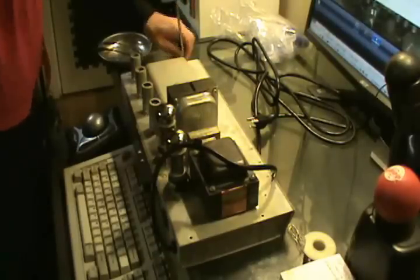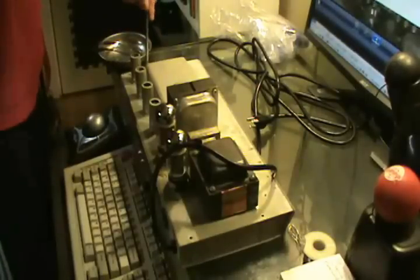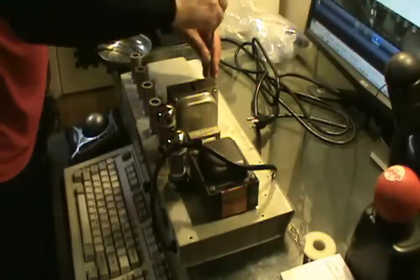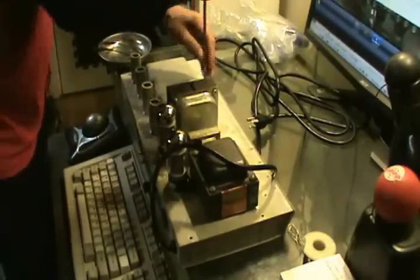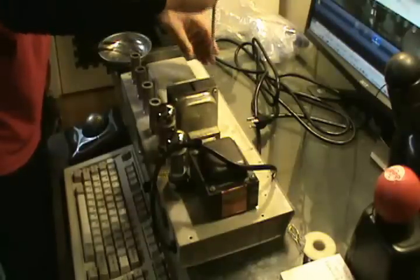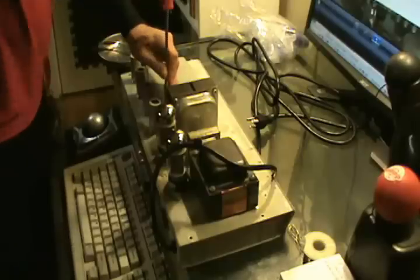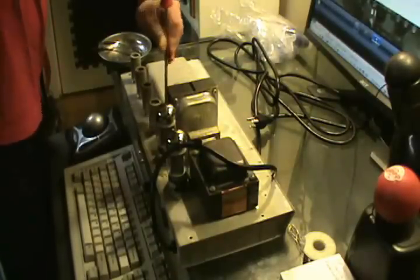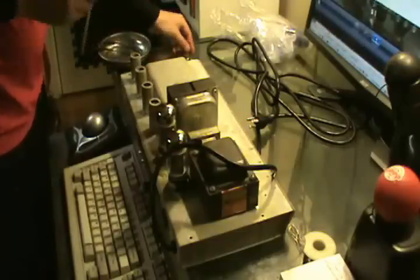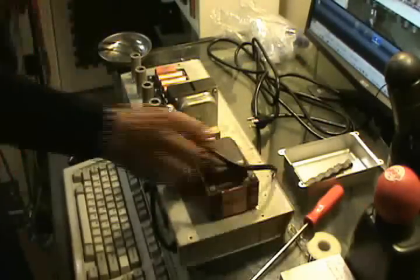All the capacitors, with the exception of the bias capacitor, are mounted under a shield can located next to the output transformer on top of the chassis. The filter section of the B+ rail consists of two 40 microfarad caps in series, parallel to the secondary winding of the output transformer. The second stage is made up of the one choke TR2. The third stage is a tank circuit consisting of two parallel 20 microfarad caps and a 4.7K dropping resistor. Finally, there is an 8 microfarad cap to provide filtering for the front end.